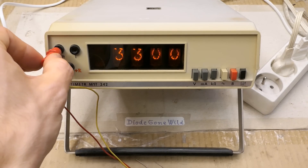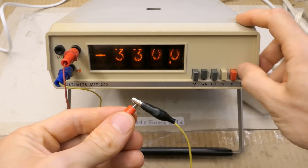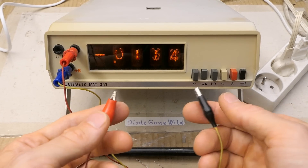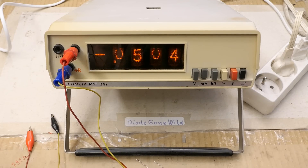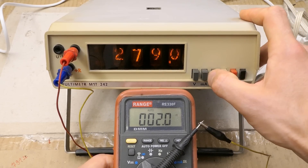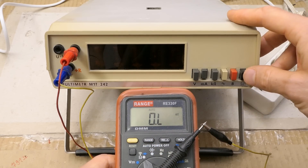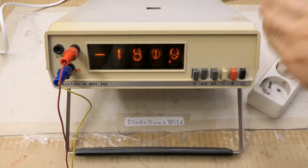The resistance measurement seems to work, but the current measurement, which uses this receptacle, does not zero out — the current measurement is bad. Now it actually zeroes out, and when I disconnect it, it's floating. Is there a blown current sensing shunt? Because very easily you can forget the probe in this hole, connect it to a voltage, and blow the shunt or current sensing resistor open. Let's measure the input resistance of the current meter. It shows a very low resistance so it's probably not a blown shunt. When I turn it off the shunt is disconnected — there has to be some relay. Because for current measurement it also has automatic ranges, so some relays must switch the current sensing resistors.